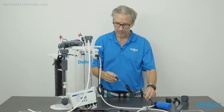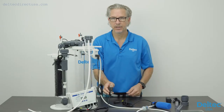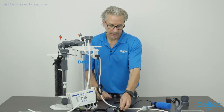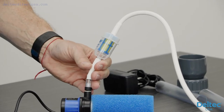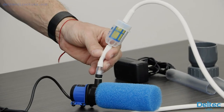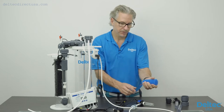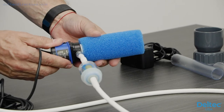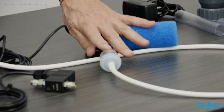The feed pump will connect to the bottom of the controller and the CO2 will connect to the CO2 tank. The CO2 solenoid should be within a foot of your CO2 tank. It's very important that it stays close to the tank — not necessarily near the reactor — so that it can trigger properly under the right pressure. With the water feed pump you have an inline filter that keeps particulates from getting into the reactor. This can be reverse flushed every couple of months to clean it. You also have an inline check valve so no water can go back into your sump when the power's out. This sponge will initially be filled with air, so when you submerge it in water you want to ring it and get it saturated so it doesn't push air into the unit. Periodically wash this sponge to keep your flow rate from going down. This filter will also reduce flow if it's not back flushed — so between these two, this controls your water pump and feed.